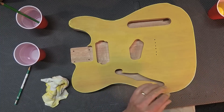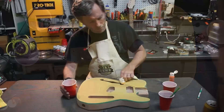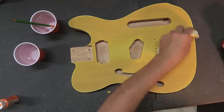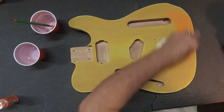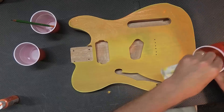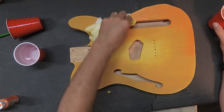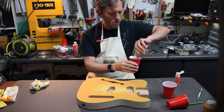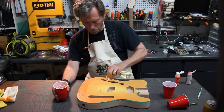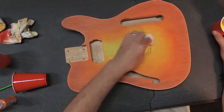Now I'm going to move to orange acrylic and add it to the yellow. This is going to give you a very yellow-orange. While you're doing this, you're just taking it up a notch from the yellow, then using a dry rag, clean it, and go to the next layer of orange. So I'm going to add a little more orange to that same yellow and rub that around the outside. As you can see, as you get it on to the wood, you come back with the dry rag and just rub that into the surface. It's a progression of that orange and yellow. Now I'm adding red into that mix — this is getting closer to a true orange, but it's giving you that soft glow. I'm going to come back with some yellow on the front and rub that back in to help smooth it out.